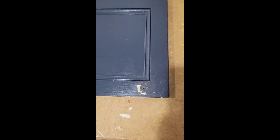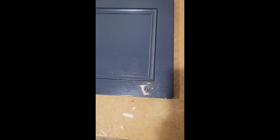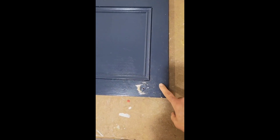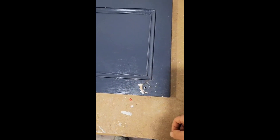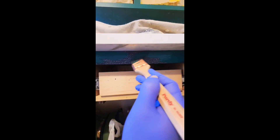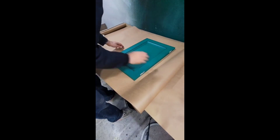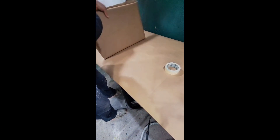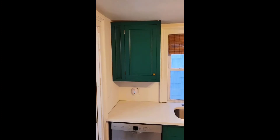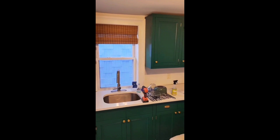To fix this you're going to have to clean it with a degreaser — I like to use brushes to get it nice and clean. Sand everything smooth, spot prime with an oil-based primer, and then go over it with a better paint. There are many paints you can choose from and they all depend on your skill level and application method. A safe bet for the do-it-yourselfer is an alkyd or an oil-based paint. There are so many factors to consider when painting your kitchen cabinets, but I'll leave a link to a DIY guide below that's going to help you pick out the right primer and paint.